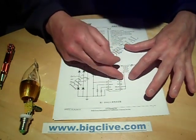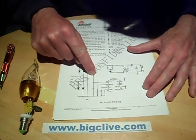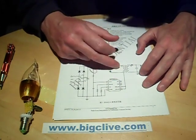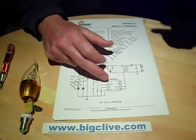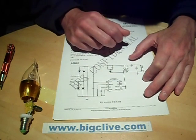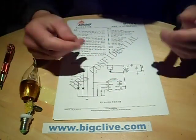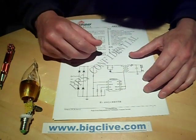It's technically a primary winding and a secondary winding. Initially, the power supply to the chip would charge through this resistor, charge up that capacitor until it reached a voltage threshold, and then the chip would suddenly start firing. When it did start running, it had a second winding which would then actually power the chip — also used for some feedback. What they appear to have done here is made the chip so low current that that resistor alone is enough to keep it running. They've basically made the chip more efficient, and they don't need the second winding, so that makes it very simple.